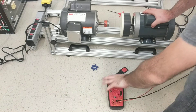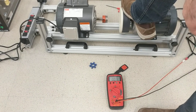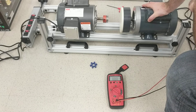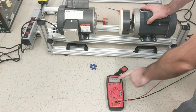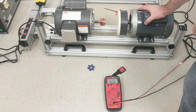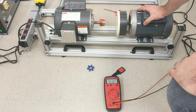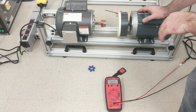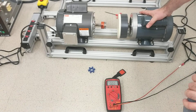Can you watch the current really, really closely? Watch this closely — hit it again. Did you see what just happened? 16 amps — there's a 16-amp starting current, it went really, really high. So that's the starting current at 16 amps, but it settles down at 6 amps. It's not really doing a great job of simulating a load.